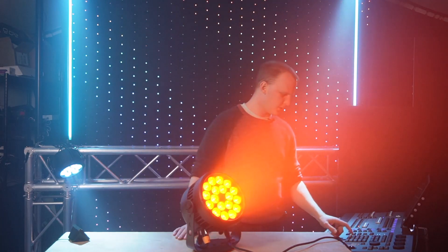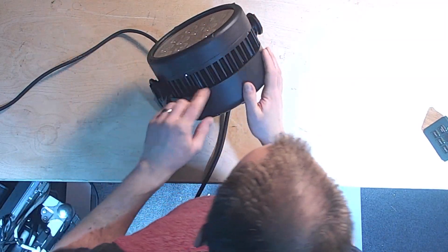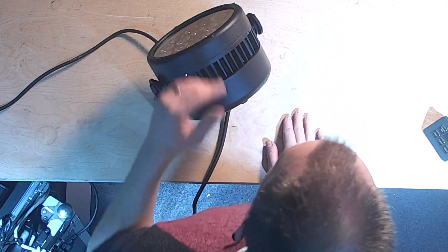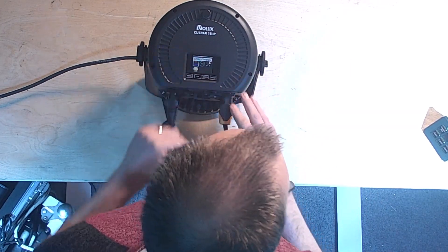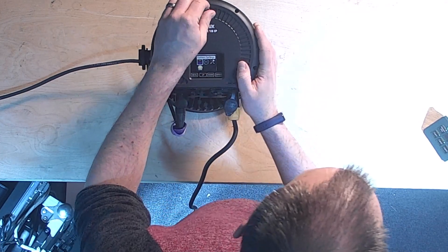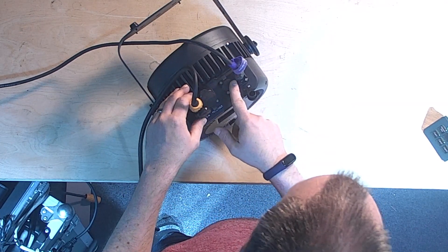Build quality feels really good and looks like a really nice build. You've got a really nice aluminum construction with airflow running through it. I don't think there are any fans — I've never heard them running, even at full. On the back there's a nice color LCD with a pretty typical menu system where you can set your address and whatever else you need. It's got a Gore valve for waterproofness to let heat and pressure out, and at the bottom it has true DMX 5-pin in and out with covers to keep it IP65 rated.